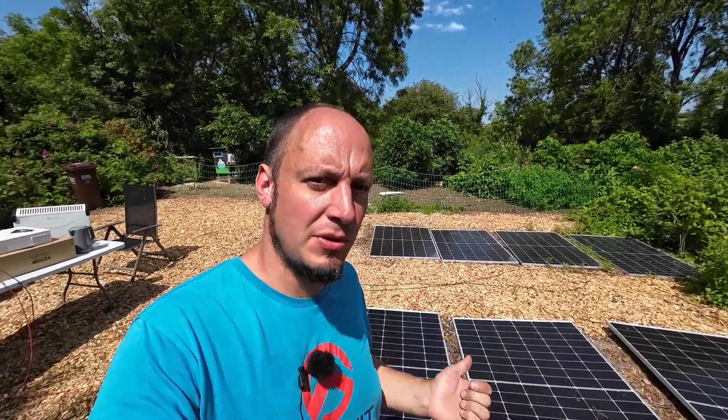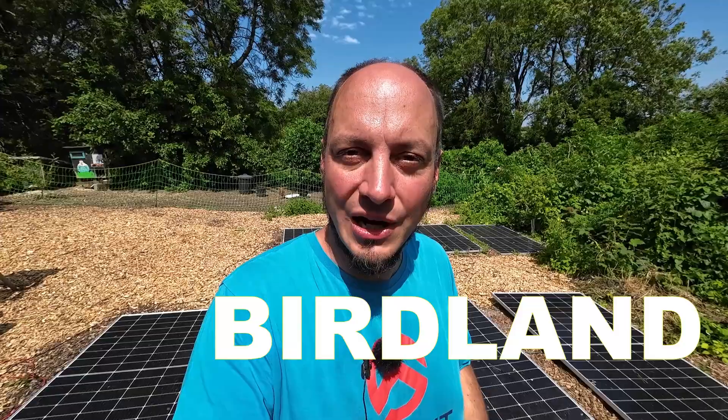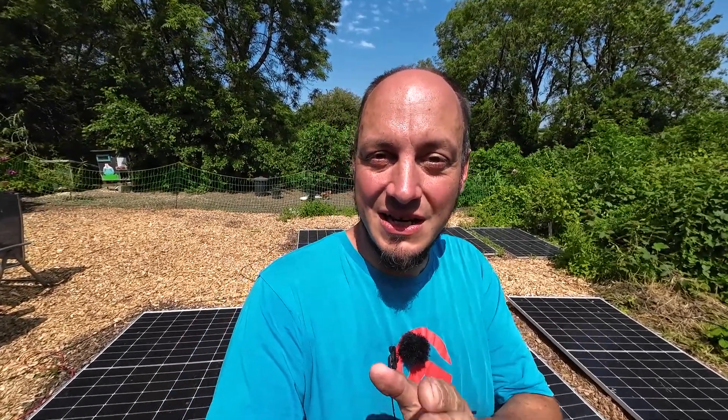I did test the system with the sun going down, and when the sun disappears behind trees, it still produces about one third of the electricity — somewhere around 900 to 1,000 watts out of 3.2 kilowatts. I haven't tested the system on a dull day yet, but we'll get to it in the third video. Please stay tuned and subscribe. Thank you for watching — check the links below and use our discount code BIRDLAND for 5% off anything Vivor. Thank you so much, and thank you again Vivor for supporting us. Please leave a comment below if you have any questions or suggestions.